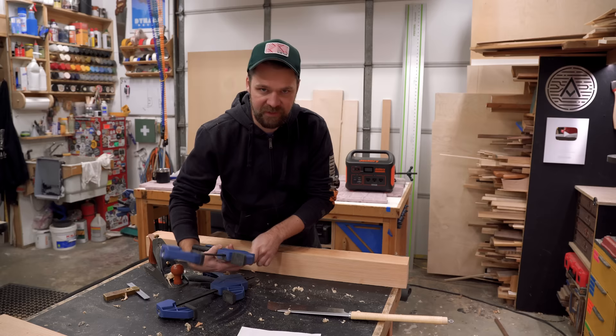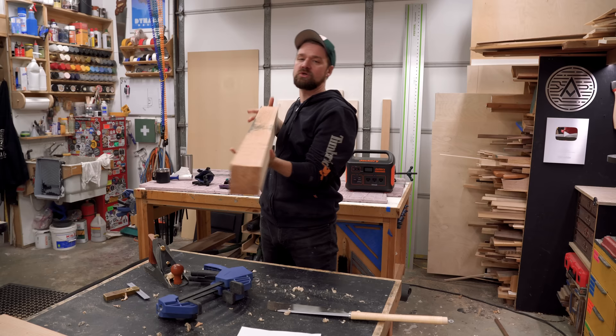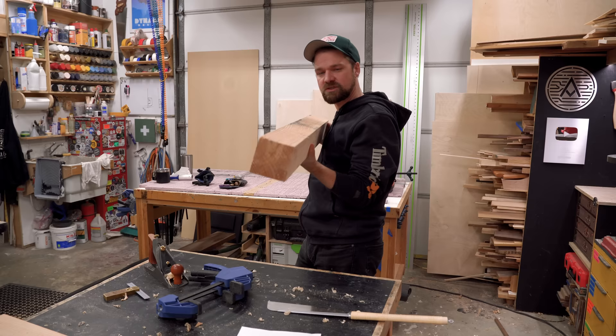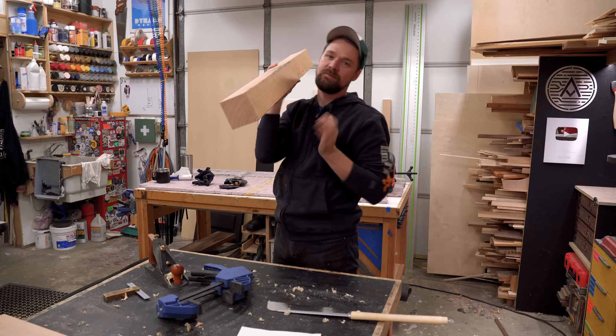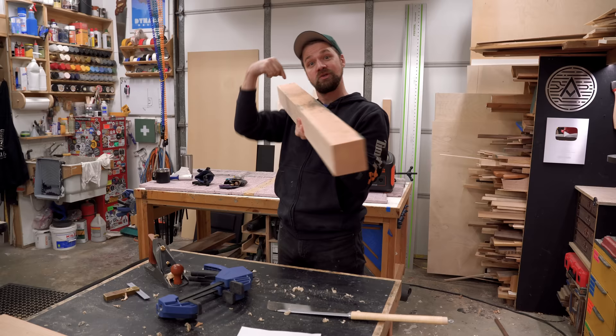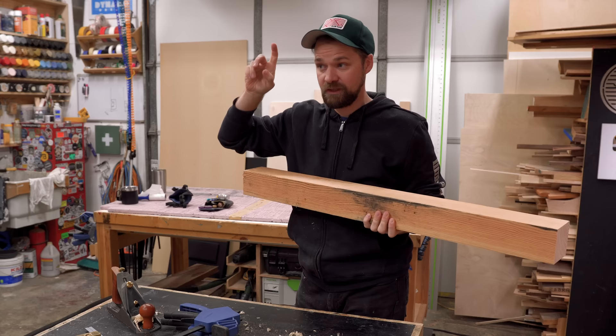This might be a little bit confusing so I'm going to do my best to explain it. Basically I'm trying to keep the same reference face on the table saw - this was the reference face that was down on the table saw bed when I was pushing it through, making sure to keep it down as opposed to pushing it into the fence which can kind of tilt it up. So just ease it through, it helps to take a real light pass on it. Now that I have this nice and flat I'm going to flip it around, keeping this on the bottom running this side against the fence which should be fairly square to the original cut, then pass this through so these sides will be parallel and I can rotate it and start cutting these faces off.